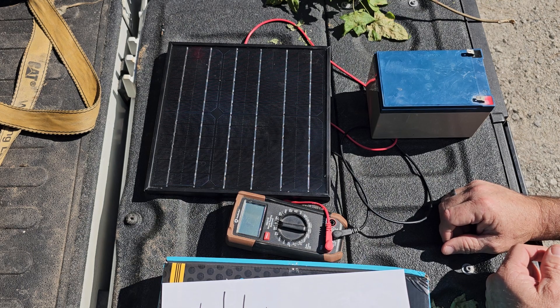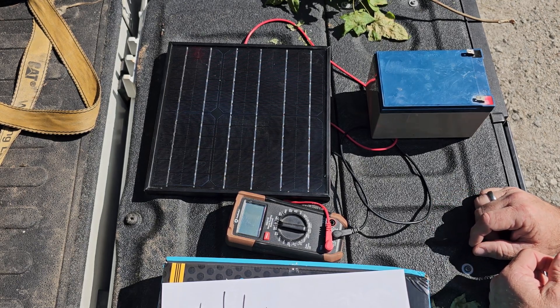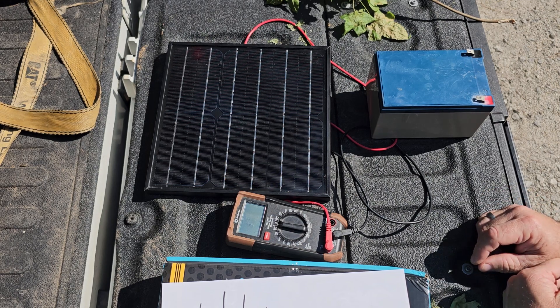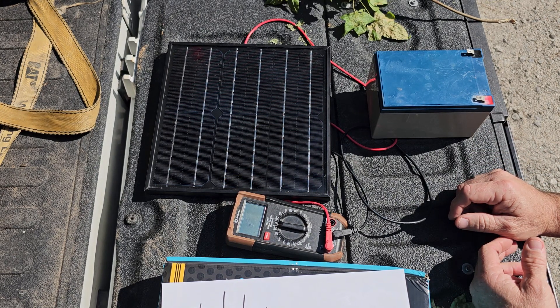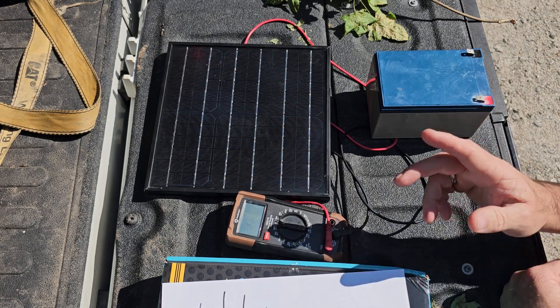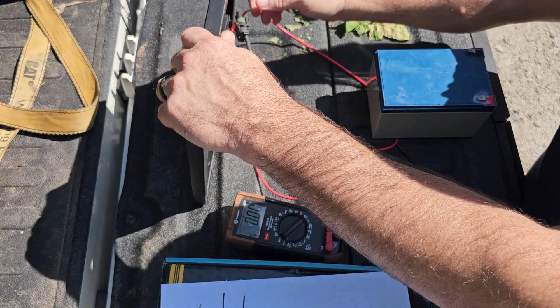What I want to show you today should answer some questions. My sun is going down - it's four something in the afternoon, so I'm starting to lose light. I get a lot of questions about shade and how a solar panel will work when sun comes down through the trees. It's really hard to say, because if your solar panel is connected to a battery that powers a camera, and you use too much battery power and the panel can't produce enough output to recover, it's going to go dead. So let's take some readings and show you how this affects the output.